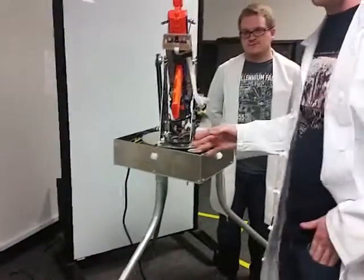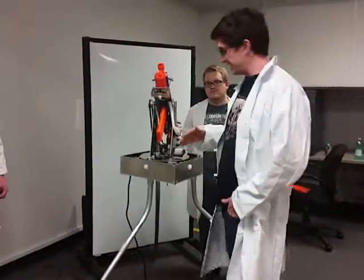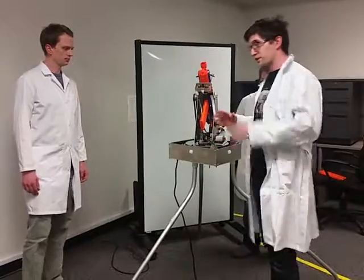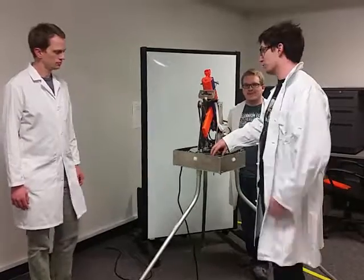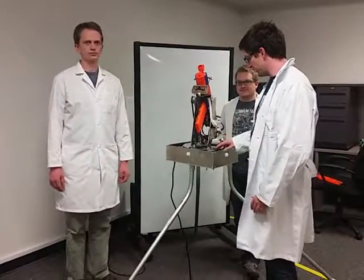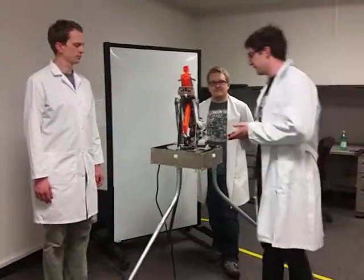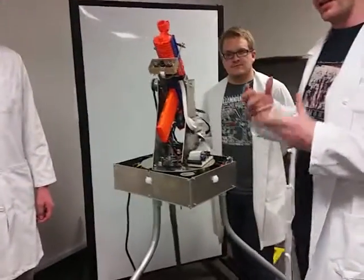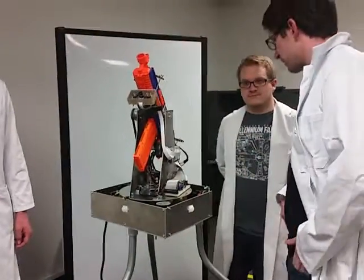And to facilitate the rotation, we designed a 7.5-inch gear, of about 200 teeth, so we could have a 1-to-4 rotation ratio. And then we also, the STM board has to communicate with our Raspberry Pi, which is the brain, and it does that all via UART communication. And from there, I'll let Alex take over.